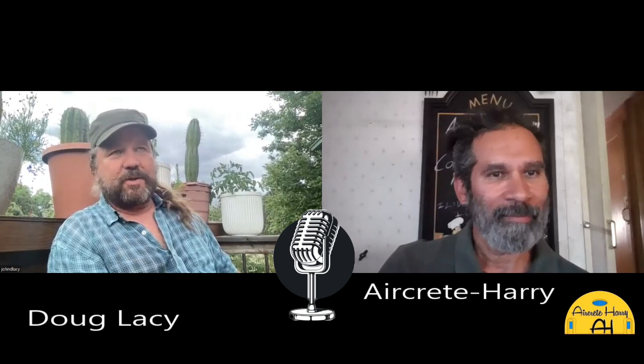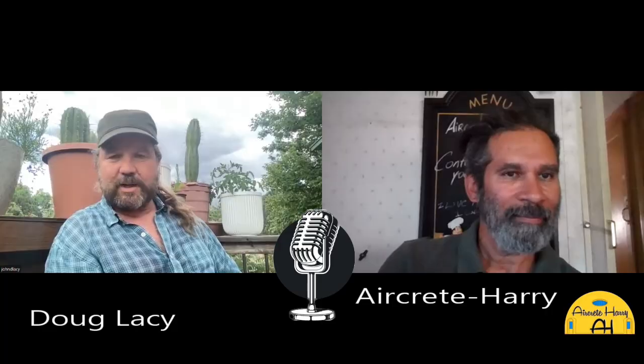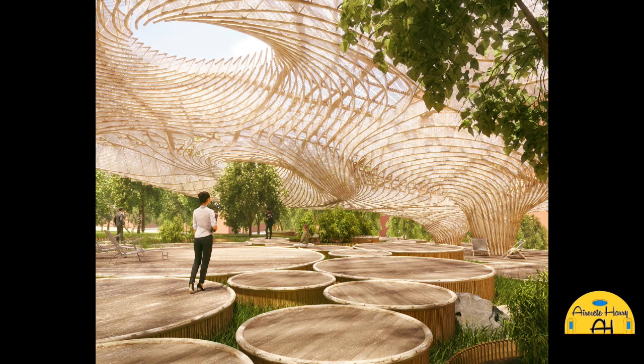Also with the shell mix, the reactive powder material, this high strength self-healing cement is very much like Roman cement, but about 6 times stronger than Roman cement and about 3 or 4 times stronger than modern concrete. We have this now, and normally the people who are making it are making it in laboratories, making precast elements using really expensive parametric design software. What I found with this framing system is that that's all not really necessary. It actually turns out to be very easy. It's just a cake recipe to make the best reactive powder shell mix.